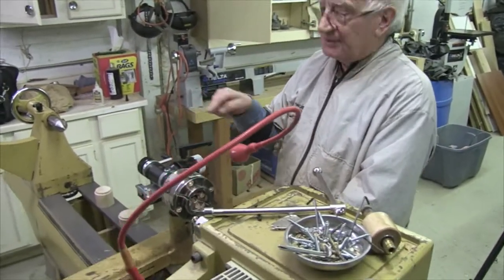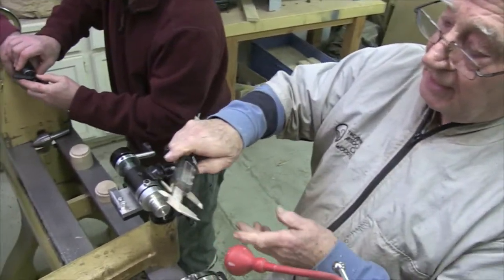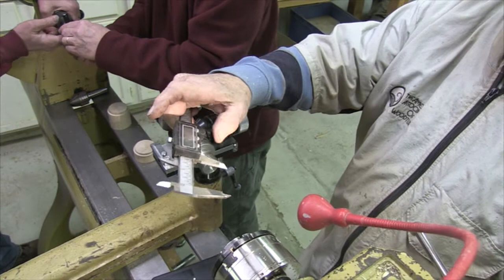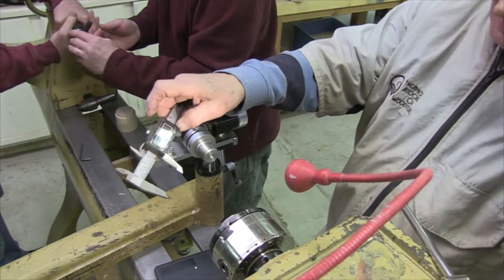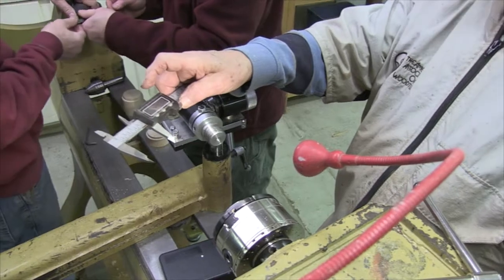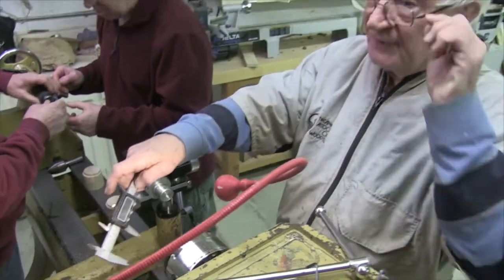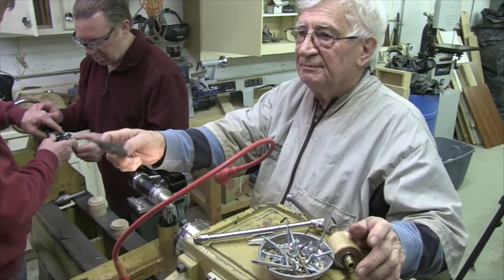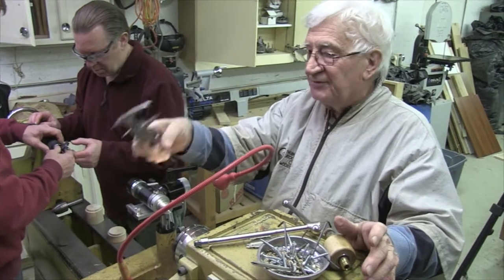Do it fully, complete, so that we have the inside caliper, the vernier at zero. After you find the inside dimension, you zero it and add 1.20 with my calipers. These are cheap Wixies. And he states in his literature that 1.10 is the number. 1.10 doesn't work with my calipers. 1.20 does. So you find whatever works for you. But these are cheap calipers, and he's probably using better ones. Mine are gimmies. But 1.20 added to it for the outside dimension.